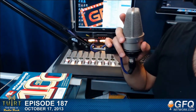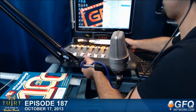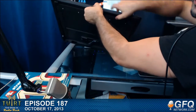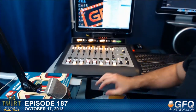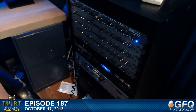Don't worry about it. So the Radius connects via a CAN bus cable, which looks like a heavy duty cat cable. I don't know if you guys could see that. Oh, my arm is blocking it. There we go. So anyway, one cable connects it over to the engine, and the engine has all the smarts, and the Ethernet switch is built in to the engine, so it provides PoE, power over Ethernet, so if you want to hook a Telos phone system to it, you plug it right in. It even powers the phones.